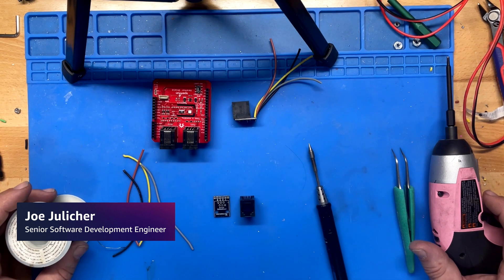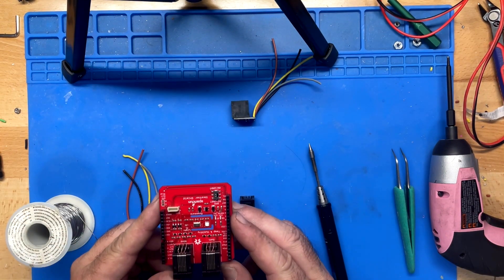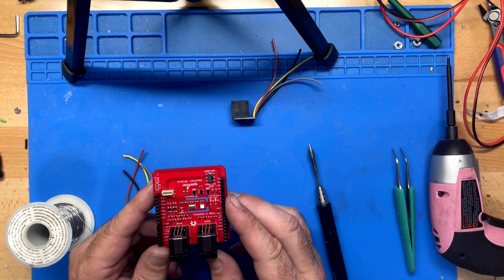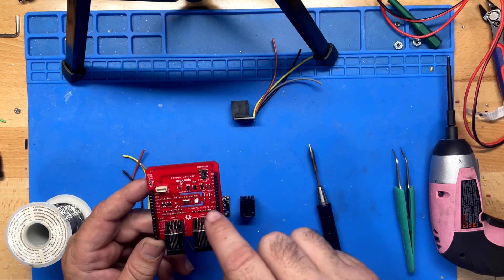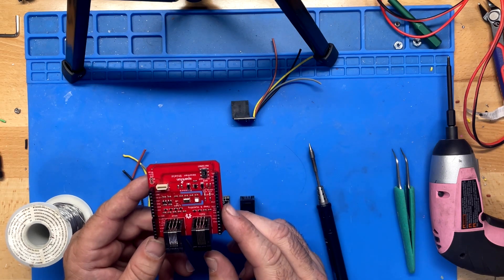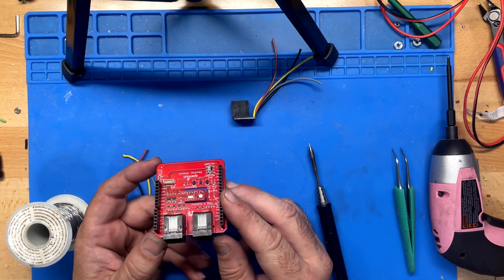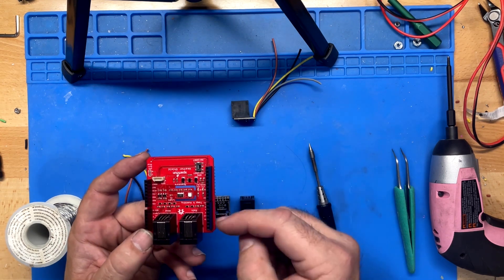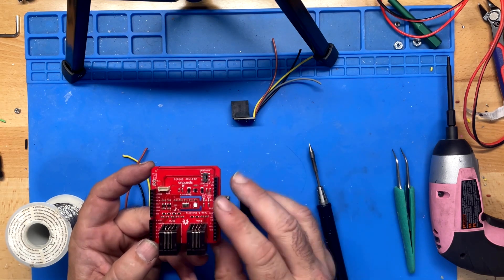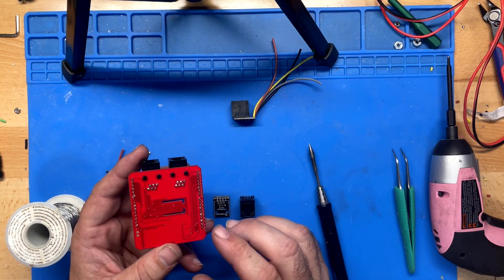Assembling the weather station requires a little bit of soldering and assembly. If you go with the UNO form factor, such as the Espressif module, then you should choose to use the SparkFun Weather Shield. The SparkFun Weather Shield provides sensors for temperature, humidity, and ultraviolet light. It also provides the connections necessary for the wind and rain sensors. However, the stacking headers and side connectors are not assembled on the device, so you'll have to plug them in and solder them down. All the components do come with the kit — they're just not soldered on.